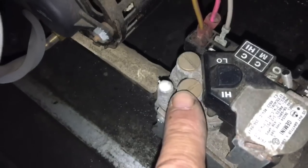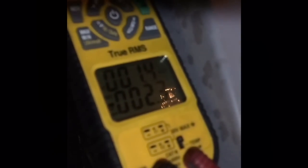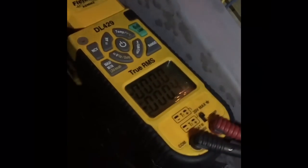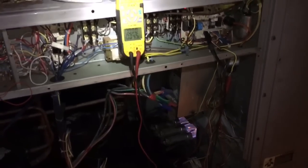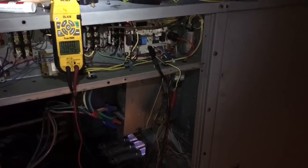That's our low setting, that's our high setting. On low fire the flame sensor is not happy; you go to second stage and it ramps right up to like 4.4. That might have an issue with my gas valve and a soft flame on low stage. On high fire she's happy. Here's low stage — the gas pressure's slowly coming up. Right when I was talking about changing the flame sensor, that wasn't the problem either, because you heard it starting to buzz again. It's a gas valve.